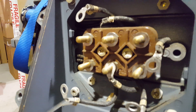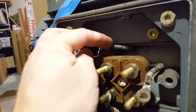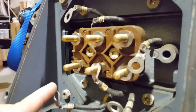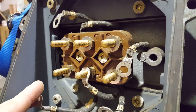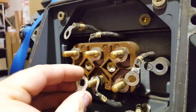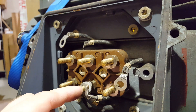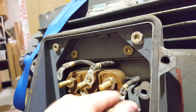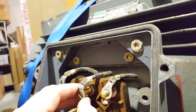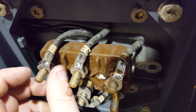What we'll do is wire this in star first. Every cable is labelled A1 and A2 - there's A1 and there's A2. For phase A you've got phase A, B and C. A1 is one end of phase A and A2 is the other end. So if you take all the 2's, or all the 1's - it doesn't matter - put them all together, that's your centre tap point for all three coils. Then you've just got your three phase input: 1, 2, 3 - A, B, C. Except it's C, A, B. But who cares?